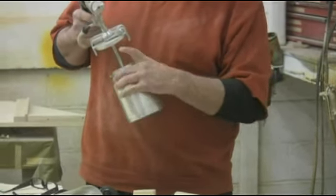If you want to protect that square look, take a quarter inch mortising chisel that ain't full of goop, and simply set it over top of your peg hole. Pop it. Clean up your corners a little bit. And drive your peg. And don't miss. When you do that, now when that's sanded, that will be square. Give you a lot more of a square look.